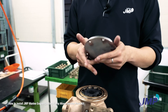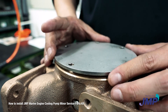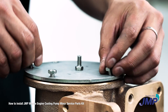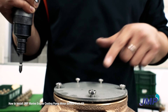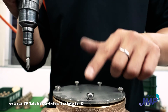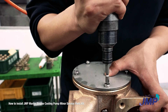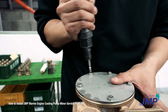The next one is the pump cover. There are five holes on the cover — align and assemble like this, finding each hole. Insert all five bolts with your hand first, always. When tightening the five bolts on the end cover, tighten them in a star pattern — this is really important, because if you tighten one bolt too strongly the balance is destroyed. Tighten to only 80% on the first pass, then go to 100%.